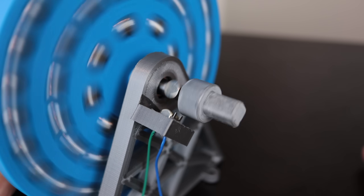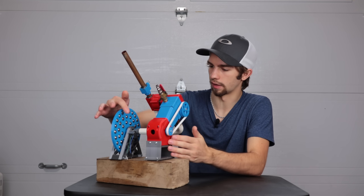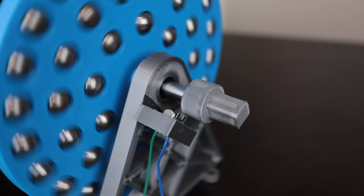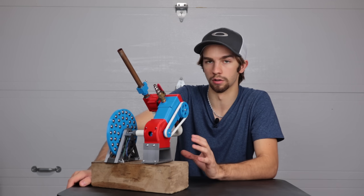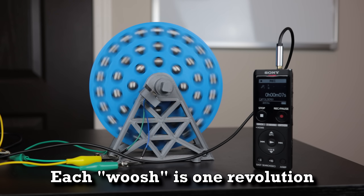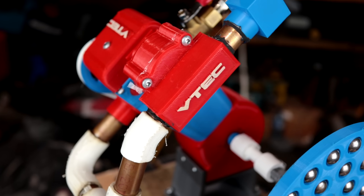The second method is way simpler — it literally requires a big disc. This is called an inertia dyno, and it has a very simple working principle. If we have a disc that's not spinning and we try to spin it from 0 RPMs to maybe 500 RPMs, it takes a certain amount of force to make that happen. So if I just spin this flywheel from one known speed to another known speed and time how long that takes, we can actually use that to determine how much horsepower our engine makes. For the setup to work, we have to actually monitor how fast the flywheel is spinning over time. My method for doing this is to place the recording head from a cassette player right next to a spinning magnet. The reading head on a cassette player is literally just an electromagnet, so by having a magnet pass by it once every revolution, I can plug this into an audio recording device and over time sample the duration between each of the peaks.